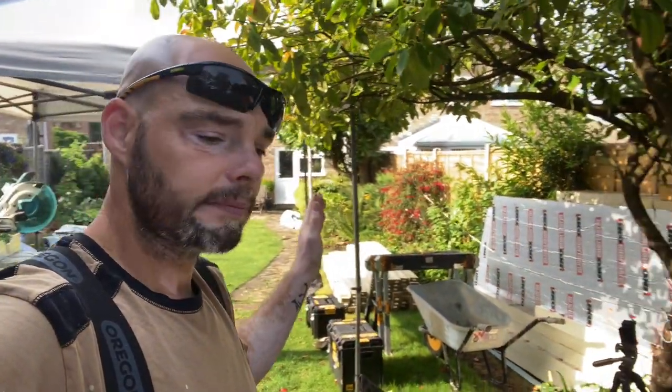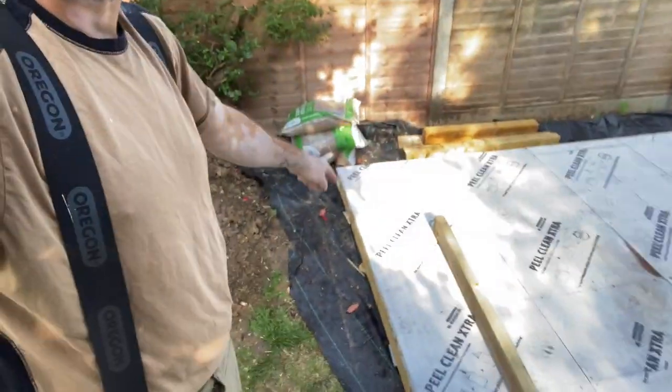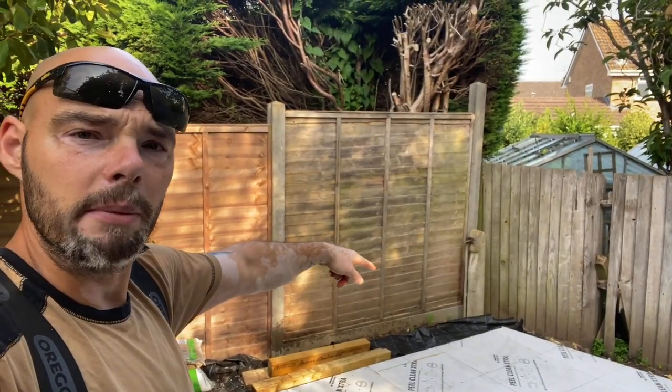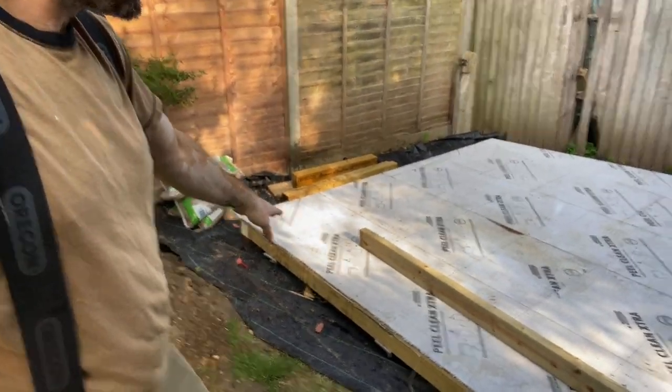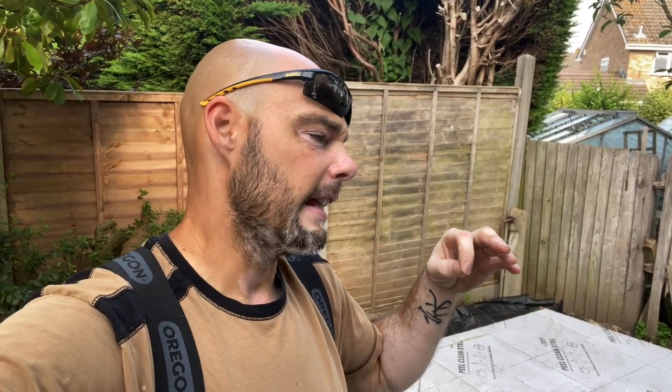So what I'm gonna do now is figure out my height. I've just done that, so I know that the wall height is gonna be 2 meters to the front wall, and 1.9 meters for the back and sides. The way you work this out is, basically, off of the deck is 200 mil for this level. We've got 2,500 to play with, because that's the maximum we can have under permitted building regulations. Then you've got 175 for the roof, plus say 60 for the 18 mil ply and the rubber joint that goes onto the roof, which brings the height up a little bit.